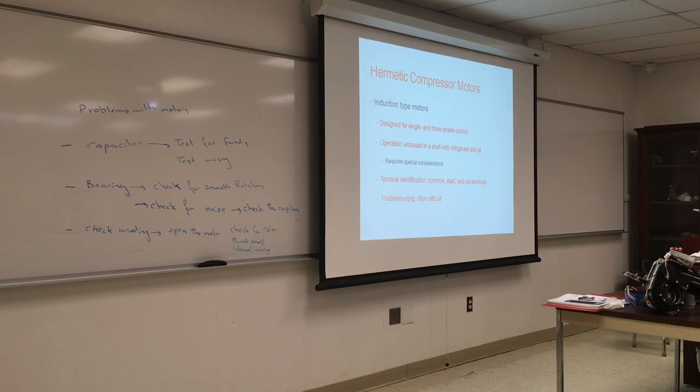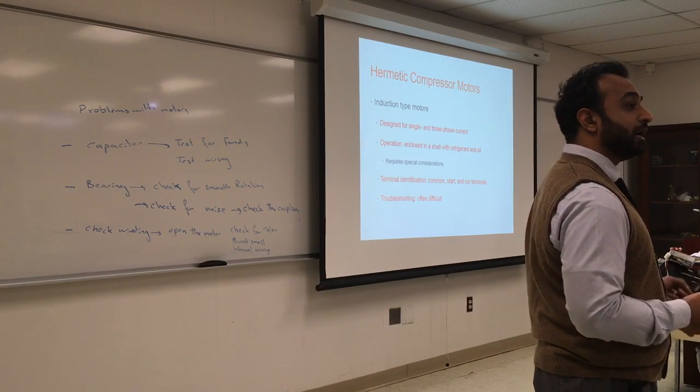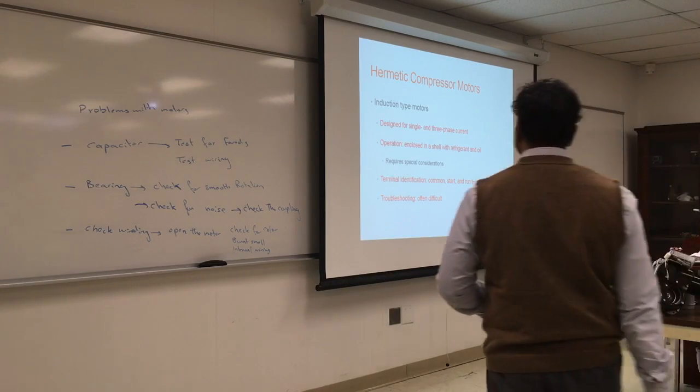How do you test for amperage draw again? You clip it on with one wire, either the hot or the neutral, and turn it on, and check for how many amps it draws. Usually it will say on it. Please remember this. It's the best way to test an equipment for proper function.